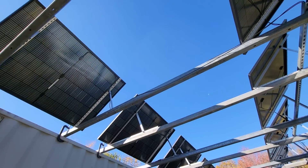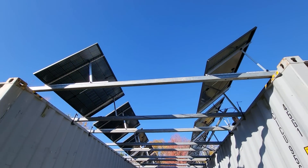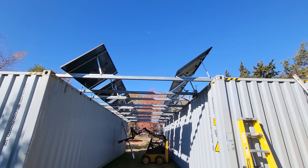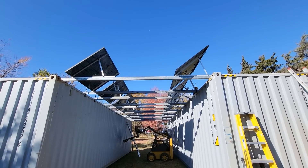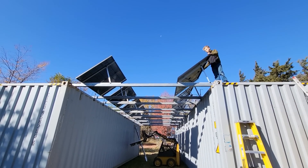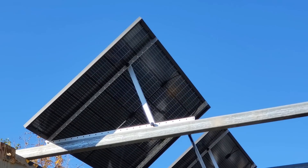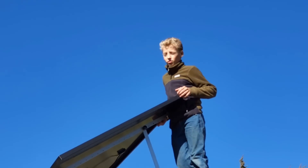You can see we just use these beams — we're about 14 feet across — and the angle of the panels is set to about 33 degrees. I think that's our best year-round angle here in Minnesota. We're using these adjustable angled brackets — I'll link to them below. Oli, how was the assembly process for you?